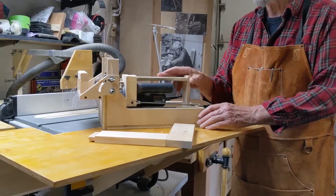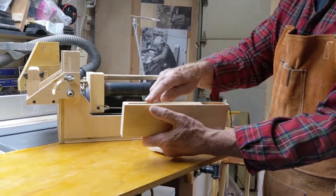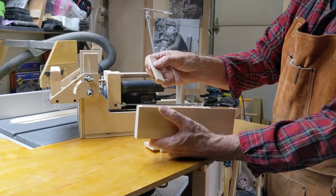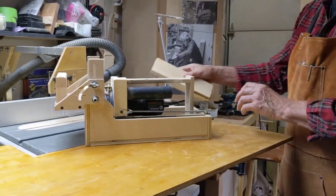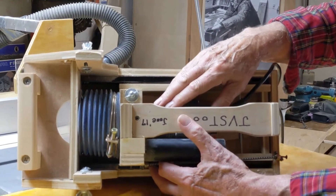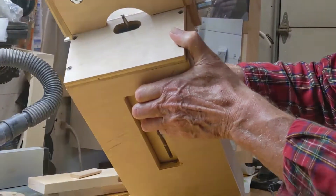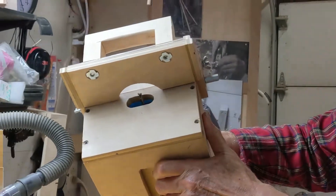You've probably heard of Festool. One of the Festool machines is used to cut mortises. I built my own — this is an example of what I'm talking about. That's a mortise and this is the tenon that slides into it. I cut both mortises with this machine, and then I use a right-sized floating tenon to go into both sides of the mortise. The way the machine works: there's a trim router on the inside, there's a hose that connects to the front, and there's a dust port that allows all the dust to be collected. There's an upcut router bit that I can move back and forth in a flat plane to cut out that mortise.